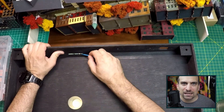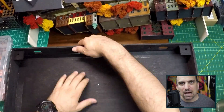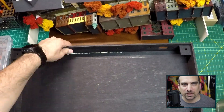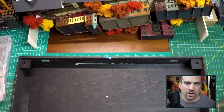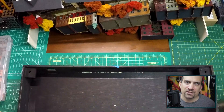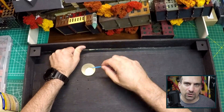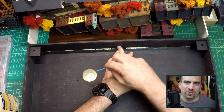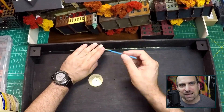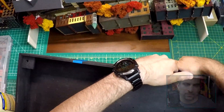before I get into the wiring I need to repair one of the modules that I previously built. During the original build I did not use enough glue on the longer seams and I did not provide enough pressure for them to set up properly. Therefore, I am now going back and trying to add more glue into the split. After getting in as much glue into the seam as I reasonably can, I just decided to run a bead of wood glue along the inside corner. While I know this will not really glue the two pieces of wood together, due to the minimal forces on the seams I figured it would minimally help. If I have further issues with these seams I will add thin CA glue into the gap.